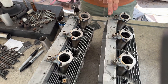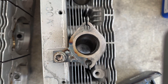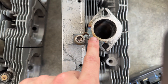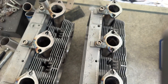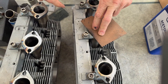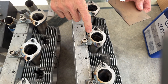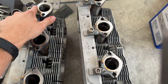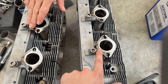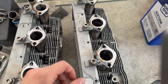These have a little bit of roughness from the welding. When I welded the tabs, I used a copper plate placed in there so I could weld without getting spatter on the seating surface. There's a tiny bit of spatter here, so I'll just touch that with an angle grinder with a little flap wheel on there, then torque the bolts up and they're done. They're still all square, just like they were — square and level. Very nice and level, and you can see down the port there. It looks nice and open.